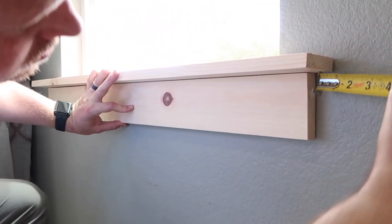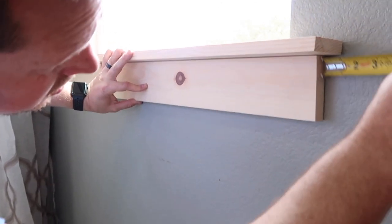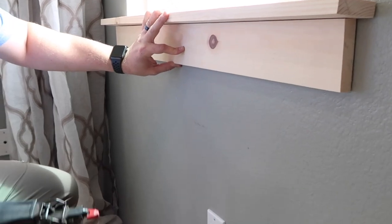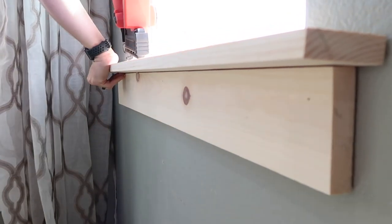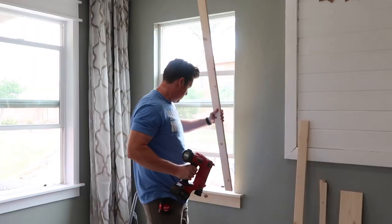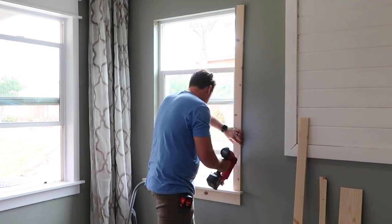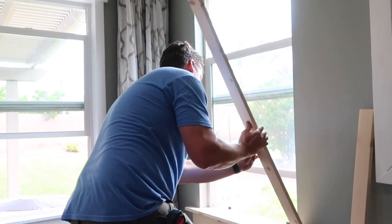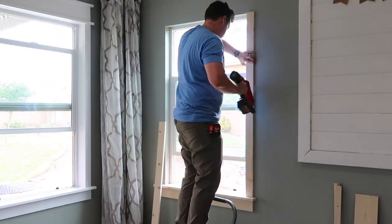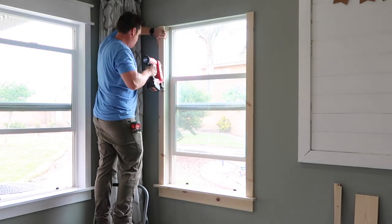You want to have a one inch space on each side of the apron under the sill. I'm using a Milwaukee M18 brad nailer to secure the boards against the wall. Scott put up the wrong board — yeah, this happens. Not all the boards we get are perfect, so I have to kind of bend and force them straight as I'm nailing them into the wall.